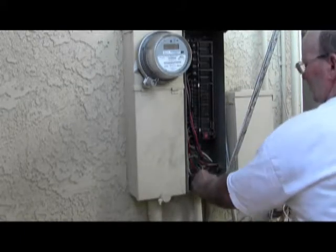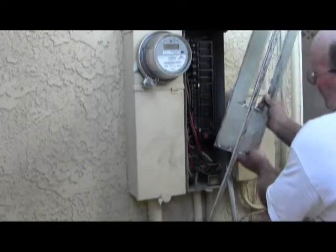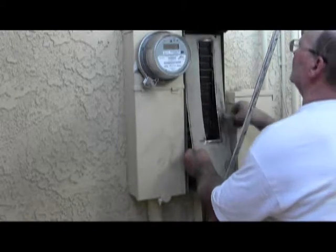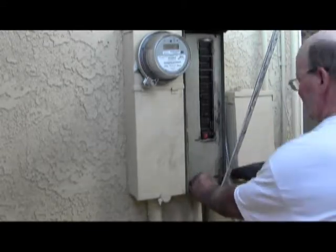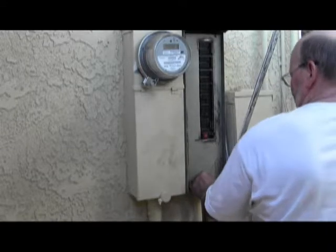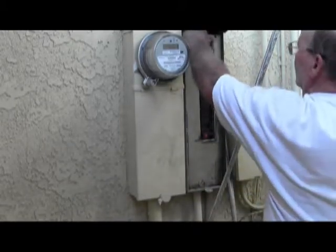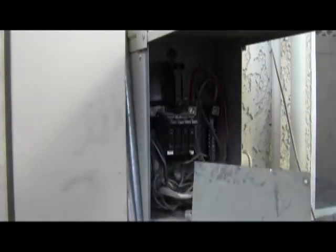As you can see, we've got our mount plate backing mounted — this is completely down. We've got that drilled and pre-drilled, and as you can see, that fits in there just so. Then we take our closure screw and we have an effective dead front installed. I just finished cutting out the rough plate for the second dead front — this one goes up in like so, and we've got a nice fit.